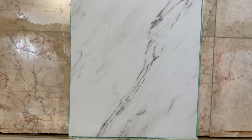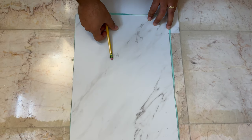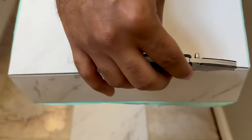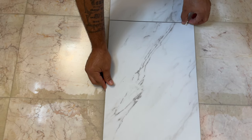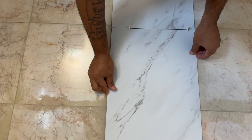You want to lay down the tiles in the middle first — I think that's easiest — and then make your cuts up against the ones already down or where you want it to stop. Cut with a box cutter for a nice clean line, then peel and stick. Here we're using spacers to give nice clean grout lines. Once you put it down, don't press down quite yet until you get the spacers nice and even.